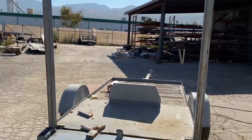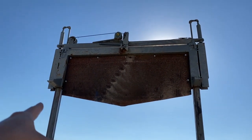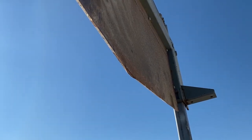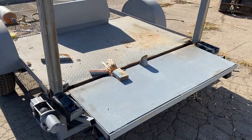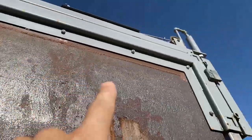This is a guillotine that was dropped off by a friend who likes to destroy stuff. He wants us to put a new blade on it — this one is a little gross looking with a lot of flat spots. We're going to make a new one so we can cut through bigger things than just a 2x4. We've got a plate of 3/8" stainless that we're going to cut an entire new blade out of.